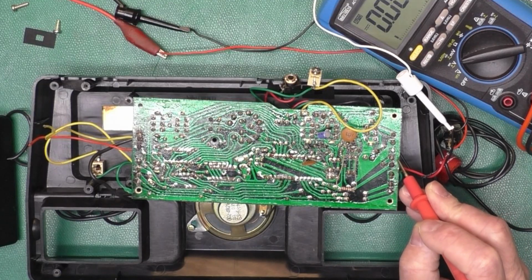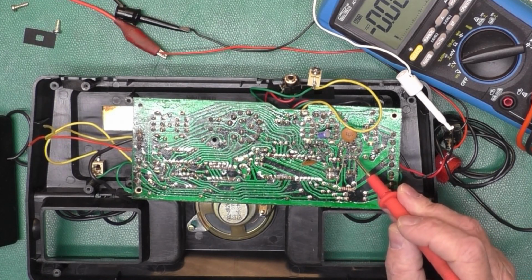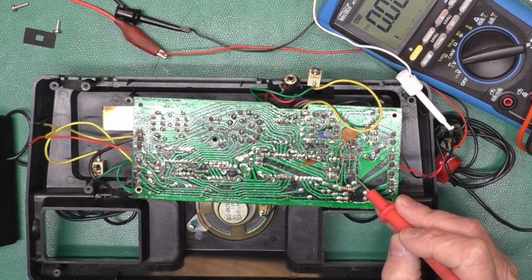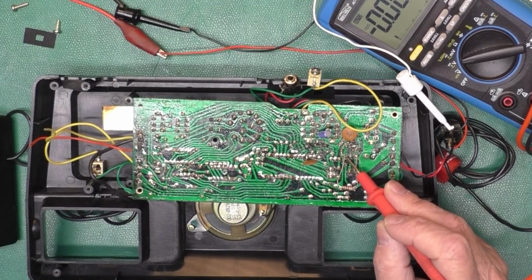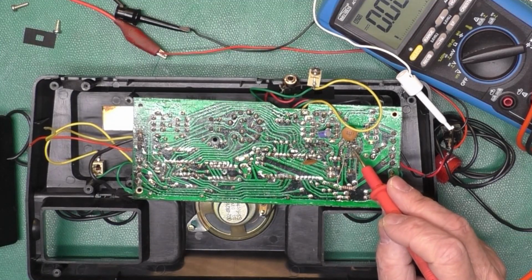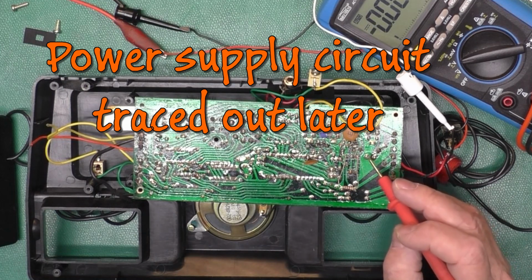What happens here is that our positive voltage comes in. It goes across this jumper here and into the collector of this transistor. There is like a 1 watt 330 ohm resistor here to the base, and I think this lets the base charge up and then turn on, and then we have our voltage over here minus whatever the drop through the transistor is. There's a couple of small signal diodes in here, which might be some reverse polarity protection. Maybe if it's AC, it couples the other half of the AC. I don't know. I've never seen a circuit exactly like this.